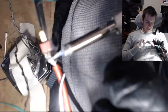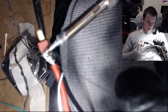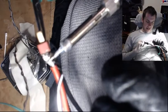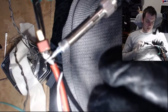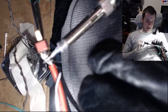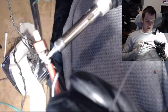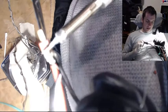And if you're just tuning in, this is a complex workaround for having a tool that's lacking a chisel tip, so it's not hot enough to just melt a tinned wire to a tinned plug. Instead, I have to be creative and just keep working it all the way around, spreading it around.